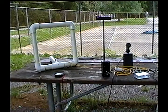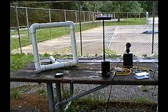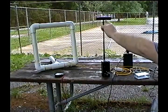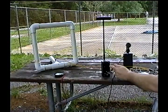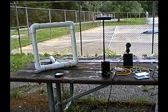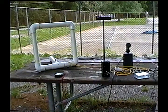So we have the portable handheld receiver — what started out as the picomagnetic receiver. I've now got the loop stick mounted inside of a five inch long piece of three quarter inch diameter pipe repair coupling. We sawed a slit down it so that it won't form a shorted turn, and drilled a hole here for a piece of quarter inch diameter ice maker tubing — it's about ten inches long. It's sensitive enough to pick up magnetic fields from the output wiring of the portable and it'll oscillate, so we've got it way up high so that it's far enough away to where the magnetic signals can't reach it. I think it's almost as sensitive as the air core loop.